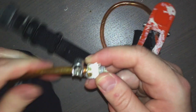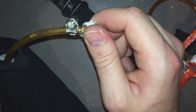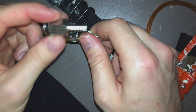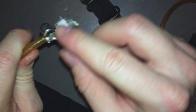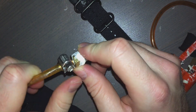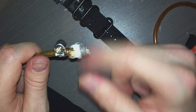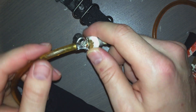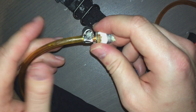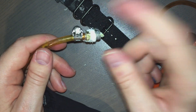The tubing I use to connect to web shooters — I've always pretty much used these barbed connectors, where a tube fits over and the barbs prevent it from going the other way. I use tube clamps to keep that down so it doesn't slip off. I've also sometimes used steel wire wrapped around and twisted to tighten it, but clamps are obviously more elegant. All in all though, this isn't super elegant — it's not easy to take the tube off the fitting. I've always wanted something better, and I think I'm finally going to move away from these connectors.